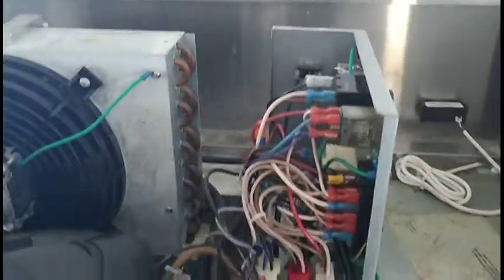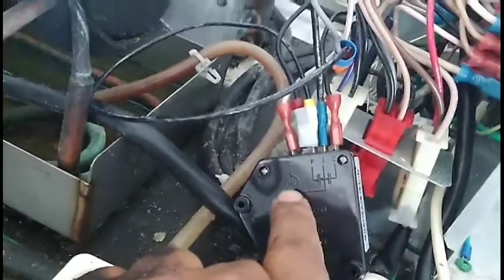Now the modification is complete. Thermostat, this gray wire comes from the pressure switch into the thermostat, out of the thermostat to the relay. You saw downstairs we had the bulb for the thermostat installed. You see the whole mod again. Basically, I traced the wires from the diagram, and this was that old OEM controller, we just traced the wires from there, and we just put them to the corresponding slots on the new one.